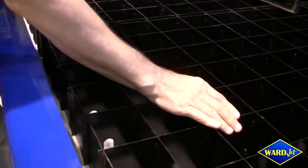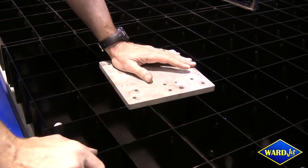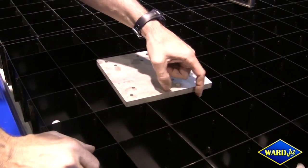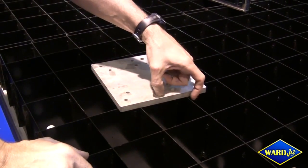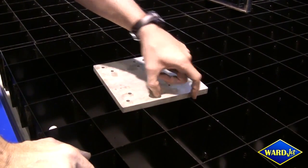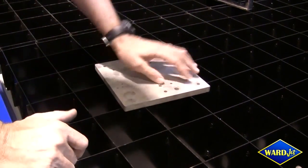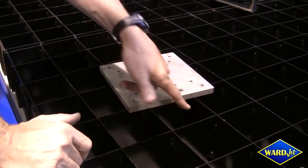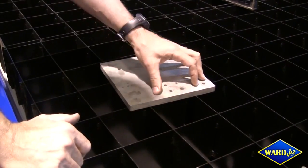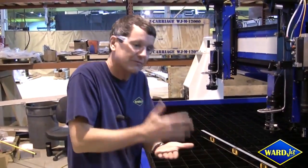By going to a very thin walled material, we are able to get away from that completely. If you can imagine, the stream now is coming along, and when it sees the slat, it's so thin it tends to literally jump over it. So it's on one side and the next second it's on the other side, and as a result the amount of time that's resident over and into the slat is substantially reduced. As a result, we do not cut so deep into the thinner material. It gives you extended life, and only possible with something like this. You cannot have thin slats.